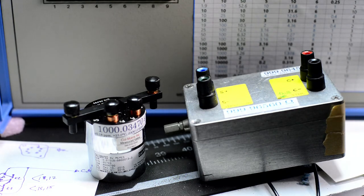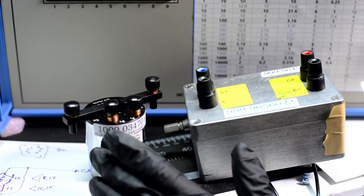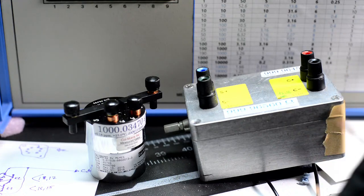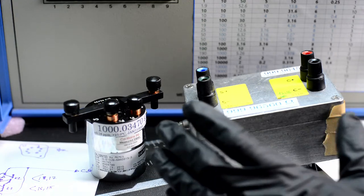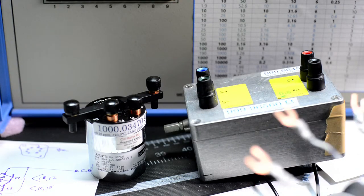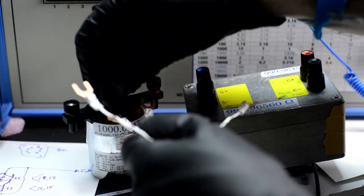So I'm just disconnecting the 0.1 ohm. Because these two resistors are nominally the same value, this is 1K, this is 1K, we will have just a ratio of 1. It's not the best way for 1 kilo ohm, because for example a ratio of 10, like 10 ohm to 1K, or 100 ohm to 1K, I'm sorry, or 10 kilo ohm to 1K would often give better results. I'll leave the question of why to the user,